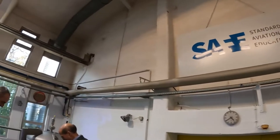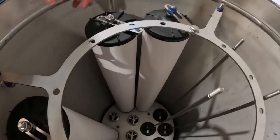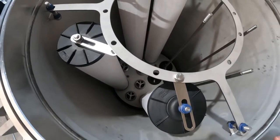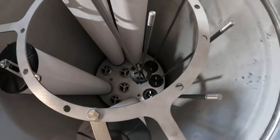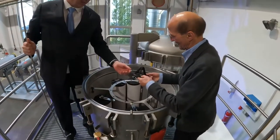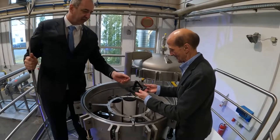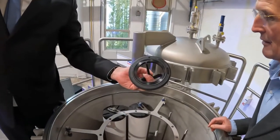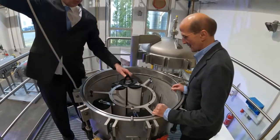And what have we got here? It is a micro filter vessel, and we have installed here micro filters — open end filter elements, but also screw base elements — and we have adapters down there. This is an adapter which supports the elements so that it will always be in the right spot, sealing properly — it's self-centred. But what we have here as well is we have an O-ring on the other side which should be changed over time, and a lot of people forget about that. So it is important that we are able to show these things to people so that they really remember and are able to make it happen.